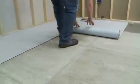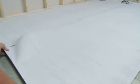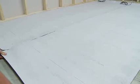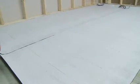Heating panels must be installed so that they will not be covered, even in part, by decorative trim, baseboards, or other structures on the floor. Note: heating panels which are covered by other structures may overheat.